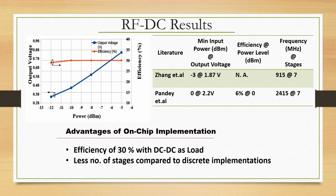that you will see efficiency which is roughly 30% all through and through. It is starting with something close to 30% and it is trying to maintain the same efficiency over a large range of input powers. The x axis here you can see is the RF input power in dBm, right. You can see that you can feed as low as minus 12 dBm input power which the antenna can take and provide you RFDC, very important note here, RFDC efficiency, it is not the complete system efficiency.